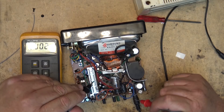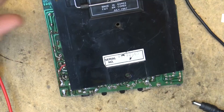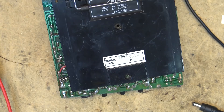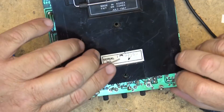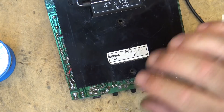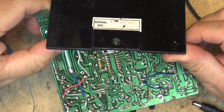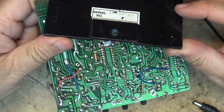The next thing to do is pull the circuit board and look at the bottom. I'm going to have to bypass the switch because I need to unplug its connector to run tests. I'll turn on my iron and bridge the connector so power is applied to the set as soon as I plug it in - that way I can do testing. The circuit board doesn't look to be in very good shape. This is typical of what Samsung stuff looked like 30 years ago - they make pretty good electronics these days, but back in the 80s their stuff wasn't that great.